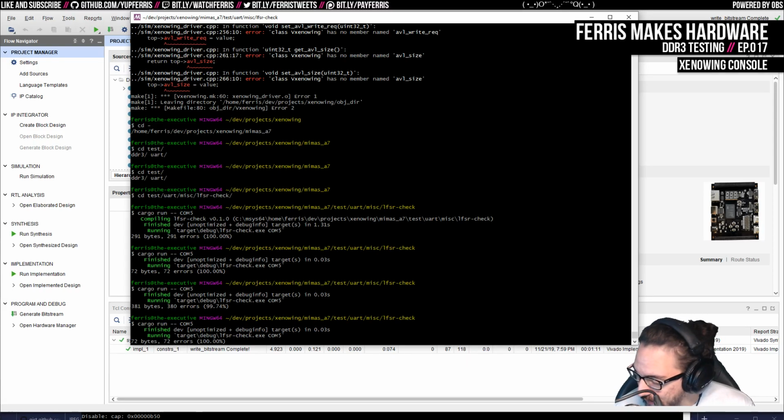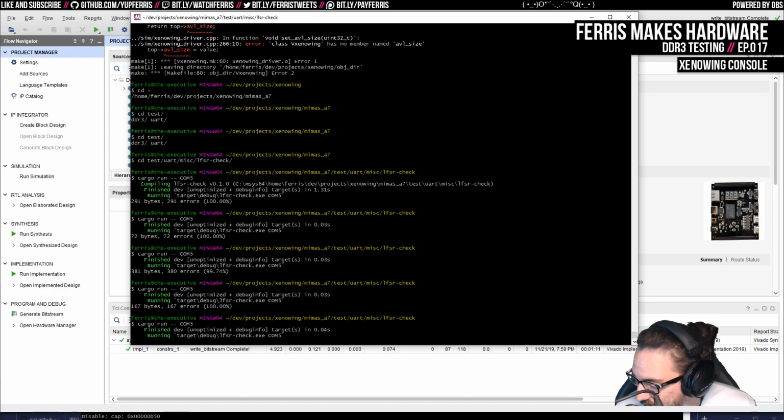And the really crappy part is that I don't have proper JTAG on this board, so I can't hook up the ChipScope thing that this board has. I guess one of the things that I can do though is that I do know for a fact that the errors are here already. If the PC is detecting the errors, then we already know the data is corrupted before it gets to this point. So we can actually conclude already that it's the transmitter that's messing up. But how or why? No idea.